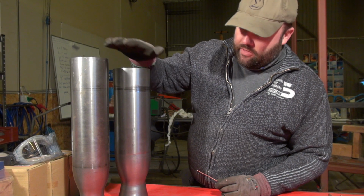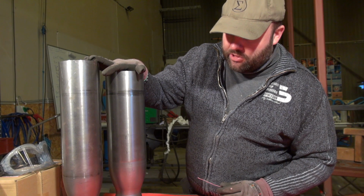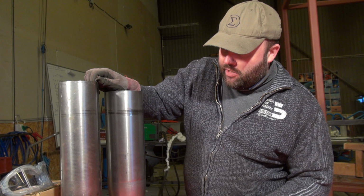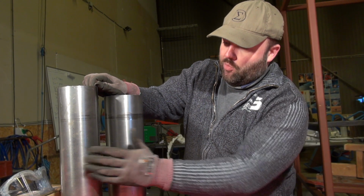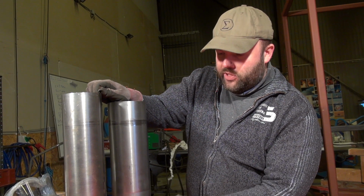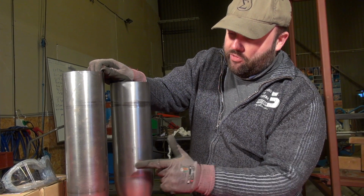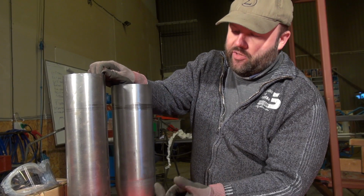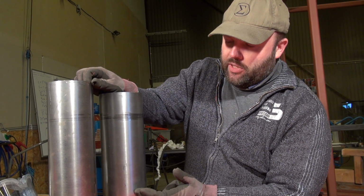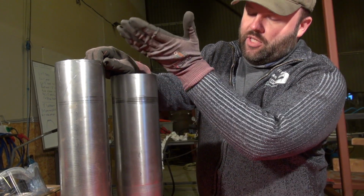This is the inner and the outer liner of the BPM-5 engine, our new research engine, and we have one particular issue that we need to address here. These two are going to fit one inside the other, and we have to make sure that, because of all the heating and warping of the metal, these two walls don't end up touching each other on the inside. If they touch, they will block the cooling fuel flow from the bottom of the engine all the way up to the injector.